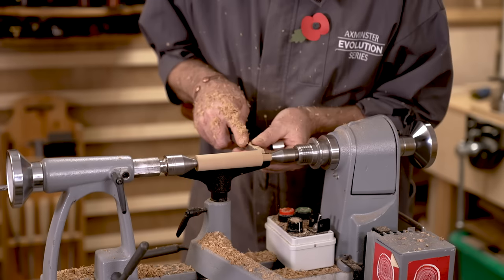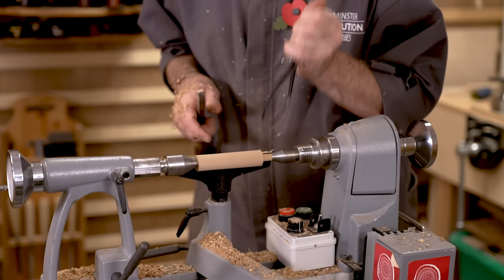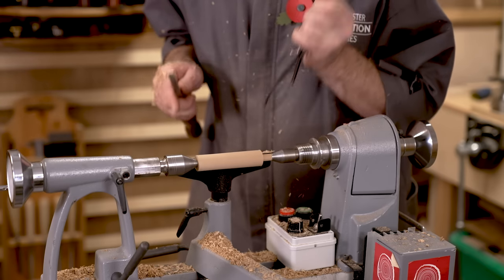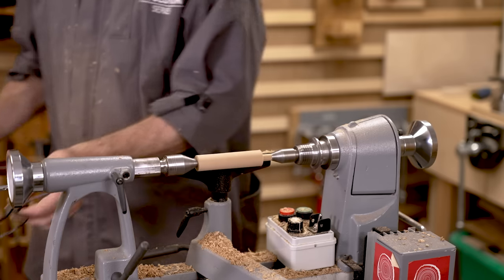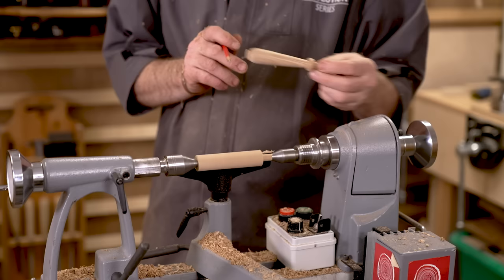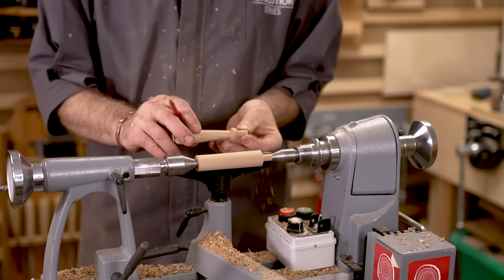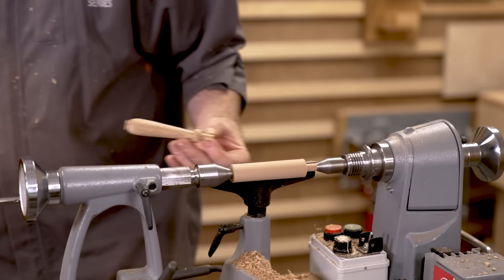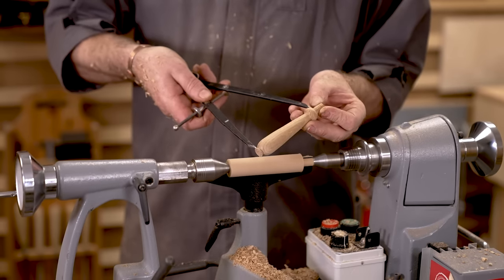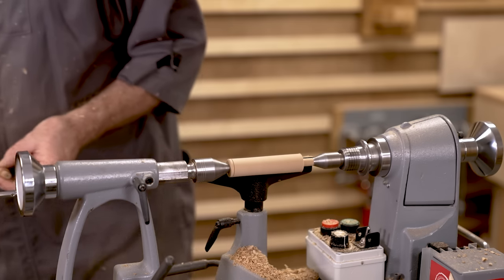And gently bring this down in diameter. Ooh, that's good, just over. All right. Let's see what that does in a second. We can test fit that in a second. Next thing, we want an overall length from the bottom of the bead to the overall length of the handle. All right, so we're going from the bead up to there. Now, the easiest way I can do that, I've now got a measuring point, bottom of the bead, set dividers, scribe out. There it is, we have that.